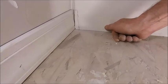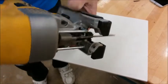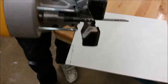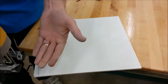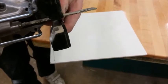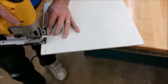Now I just need to cut that. I'm going to use a saber saw to cut along that line. Most of the time when you buy saber saw blades, the teeth are actually pointing up so that when you cut, it pulls the saw against your work. I've got a reverse tooth on this so the teeth actually point down, which is going to try and make it jump. You just have to make sure you hold it really tight against the work.